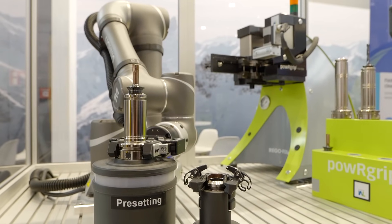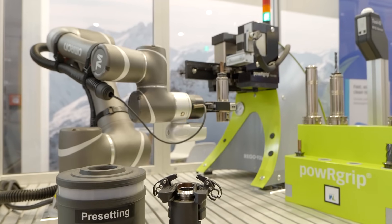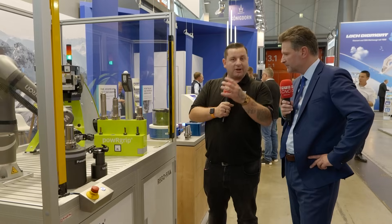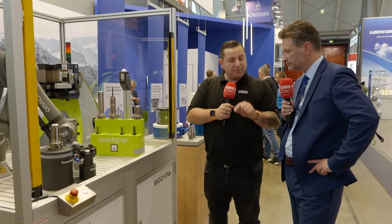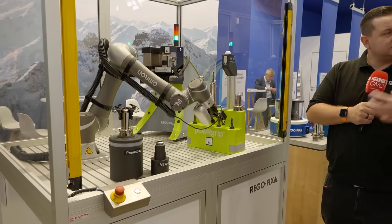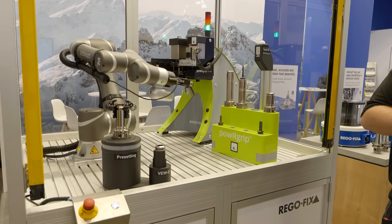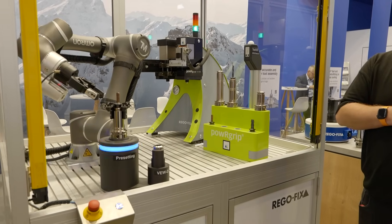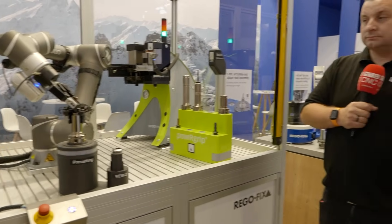And I like how it's not just pre-setting it, not just getting the tool set — it's actually using the RFID scanner. So it makes it really quick and simple for the human at the other end to make sure that goes in the machine, and when you press that green button and that tool comes in, it is set and there are going to be no collisions. Because if you automate a tool change, you will always then take the tool holder and walk to a pre-setter machine — and that's manual work. Nowadays the technology is here. We can automate this, we can write it on the RFID. There is no need for that extra step. If we are talking about smart processes and automation, we need to add as much as possible from the entire cycle — not just focusing on one individual thing like the tool changer. And that's what we have happily achieved with this new automated pre-setting device.